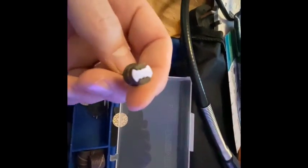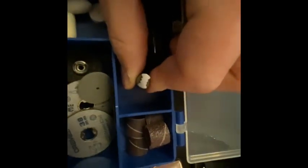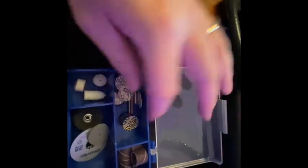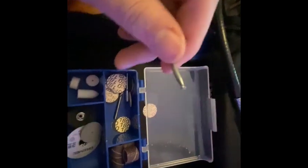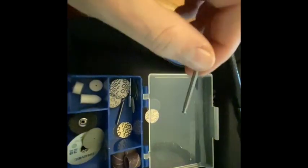This is the attachment which screws into the polishing pads — also included with the Dremel. Where you're polishing metal, that felt pad screws in, you dip it into your polishing compound and away you go. This is the EasyClick system — something Dremel have done for their sanding and cutting discs to simplify changing things. It's on a sort of spring with a butterfly shape that fits into the discs. You turn it 45 degrees and it locks in — a really clever system that should make things a lot quicker. There's also one carbide wheel engraving bit, which I've found really useful, especially for taking out material.